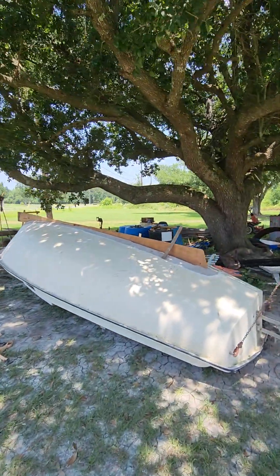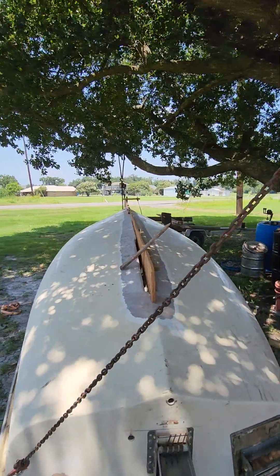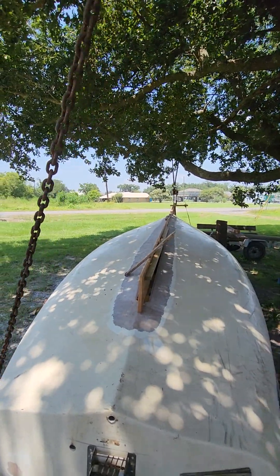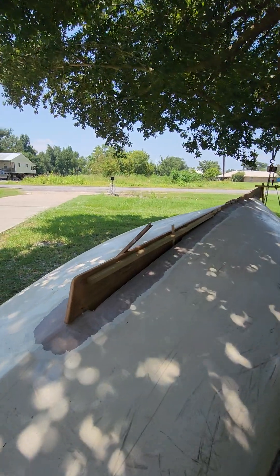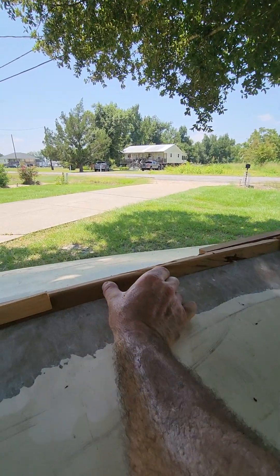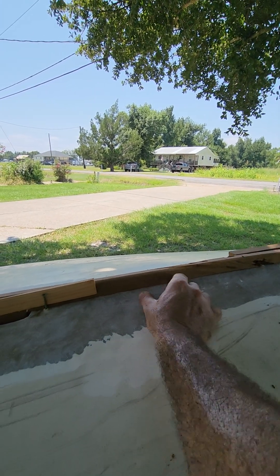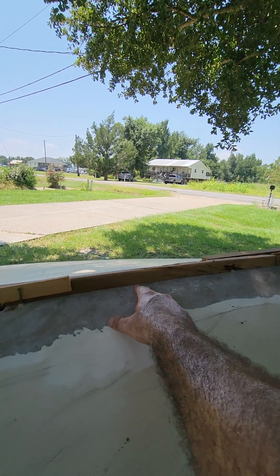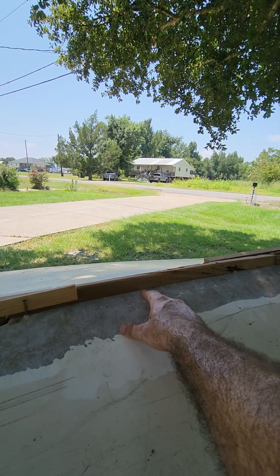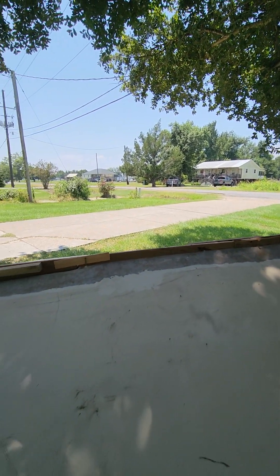Welcome back. I haven't been able to do much work for the past two days, but I'm slowly getting the keel straight. I temporarily got braces and standoffs to hold the keel straight where I want it. My next step is to start tacking it in by spots with fiberglass with angel hair. It's hot out here today — I'm all sweaty — but I've got a nice breeze and I'll be in the shade all day. I'm gonna tack this in quite a few spots, maybe 10 spots.